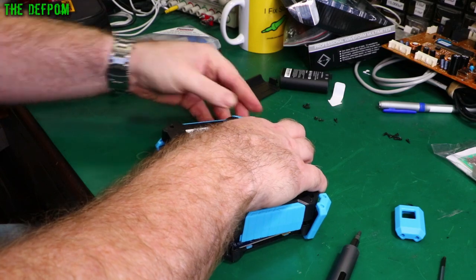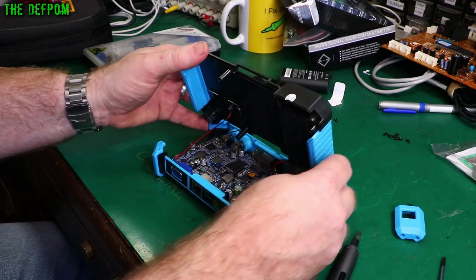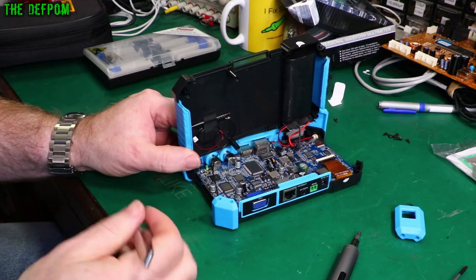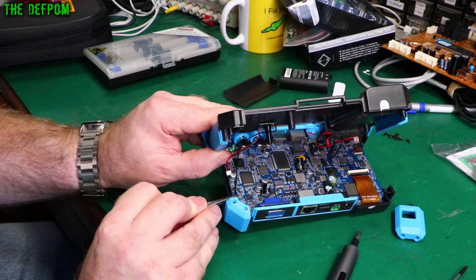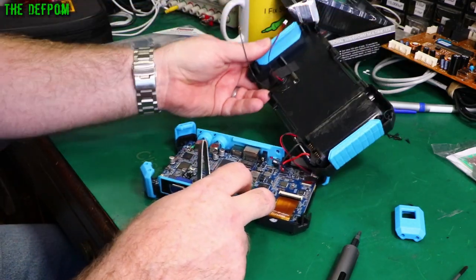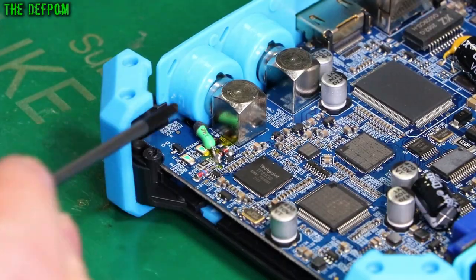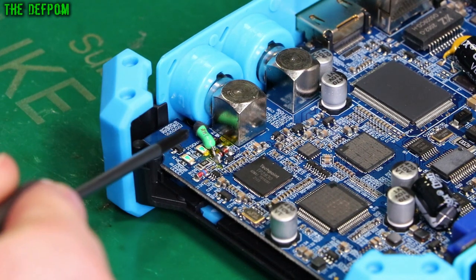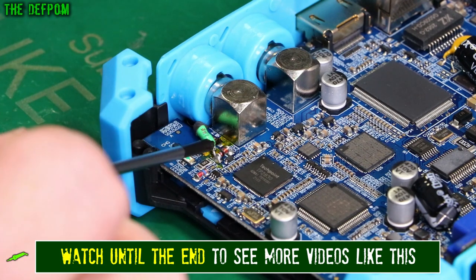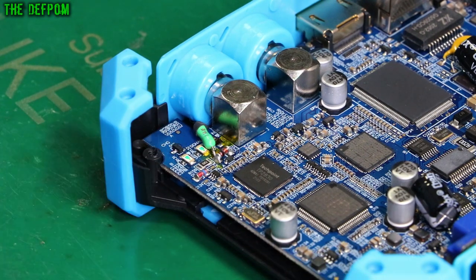Let's pop this casing open — the back came off. It's got these extra wires which I've got to unplug, and there's also a RF cable. Then we can fold it over. I may not need to take the board right out this time. So if you look just over here, you see this looks a little bit unusual — right here is a resistor that I put in, a fusible resistor. I'm going to leave that there, I'm not going to take that out — that is a bodge I put in, I'm going to leave it in place.